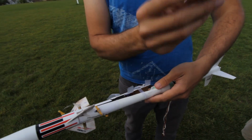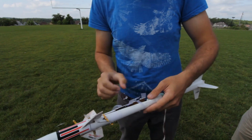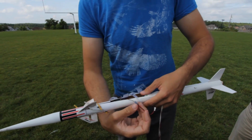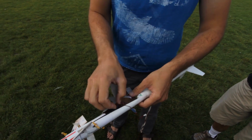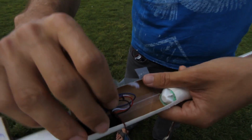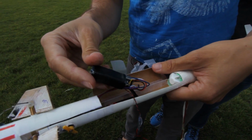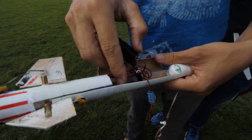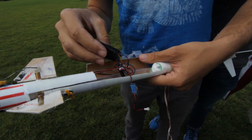So here's a little tiny battery. So adorable. 1 cell, 2. And then this thing is a little power regulator, just to get 5 volts out of it. And then here is the Arduino that's all packed up inside. Wow, that thing's tiny. So this is an Arduino board? Yep, it's an Arduino Nano, Atmel 328. This is the breakout board that has the accelerometer and gyro. It's got all that junk on it. I'm only using the gyro.